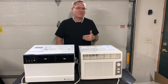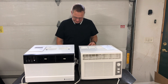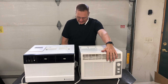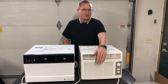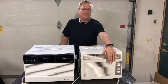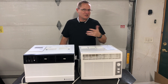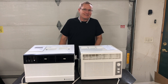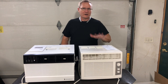On high, we jumped up to about 365 watts — somewhere in that ballpark of 360 to 365 watts, and we have cooling action still going on. It's going to take a little time for it to really ramp up. Now I can start to feel the temperature dropping a little more, and we've pushed up to about 375 watts. It's still climbing — we're getting a little cooler in the front and up to about 380 watts now. We're getting some nice cold air out of the front and using 385 watts of electricity. After about 5 minutes, it has settled down to 380 watts — that's where it's holding, blowing very cold out the front and very warm out the back. We're going to shut the GE unit off now and go over to our Friedrich unit.